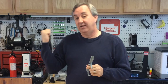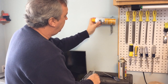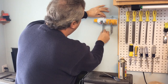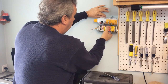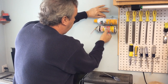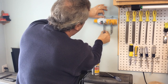The next step is to install it next to my bench. I mounted the first one with two screws — because they lock together I don't have to put screws in the second one. Then I measured and I wanted this slightly on an angle so cans slide in this way and not the other way, and can hit the edge of the board. So I need to position the second one up slightly from the first one at the right width for the can. As I put the can in they flex, and because the spacing is designed to accept the can while flexing a little bit, that stops the can from falling out. Because I printed this in ABS it's definitely flexible — more flexible than PLA would be.